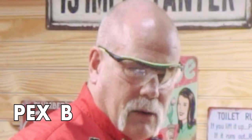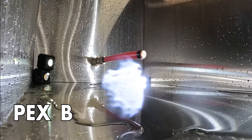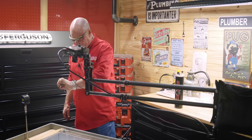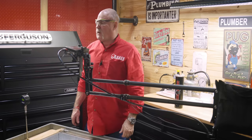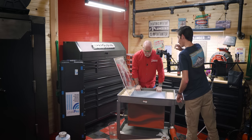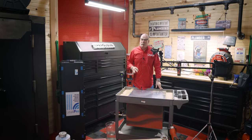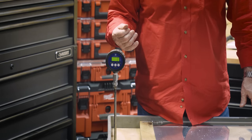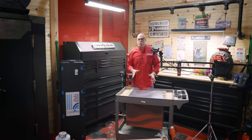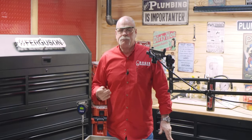We're back with PEX-B. I kept spinning it and turning it looking, and Randy it is 12 o'clock — that water came straight up. Now we're back to PEX-A for our last one today. I'm actually kind of surprised so far — PEX-B has gone over 1100 PSI, and PEX-A didn't quite make it to a thousand the last time when I went full blast. So I'm going to turn it on slow like I did for the last PEX-B and let's see what it does.